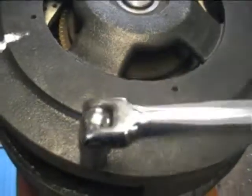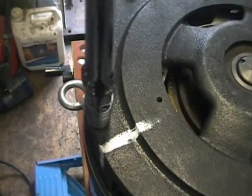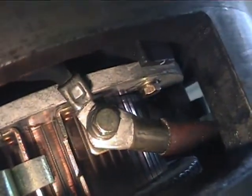There we go. I'm going to spin down these other two now. We can put the brushes back in and hook up the cables inside, and we can give her a spin up. The point I discovered here is that because the brush plate has now changed its position, the armature cable is a little bit tricky to get back onto the terminal — just something to observe. You'll have to kind of bend the cable a little bit just to get it back onto that terminal happy.